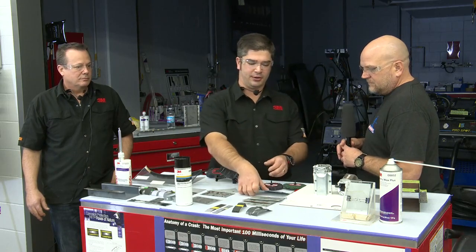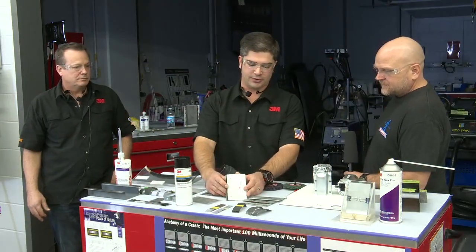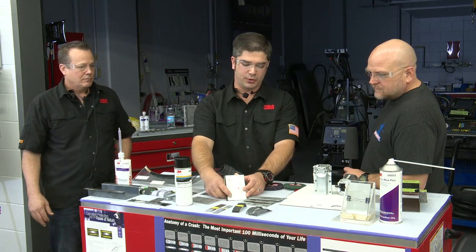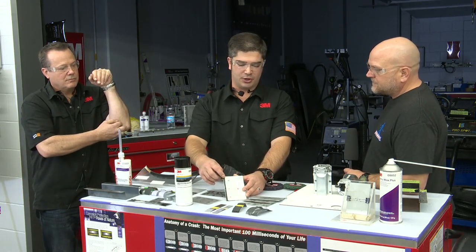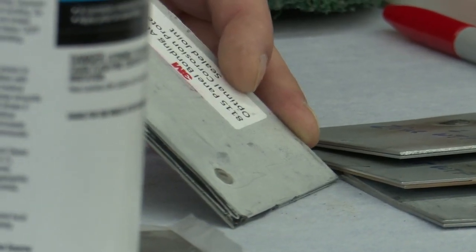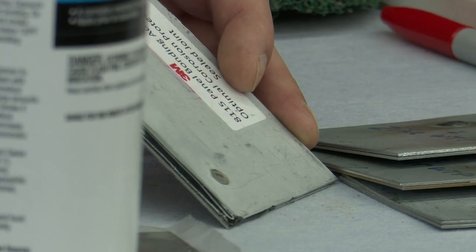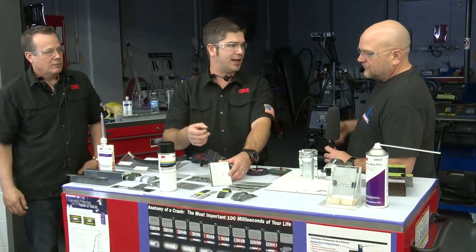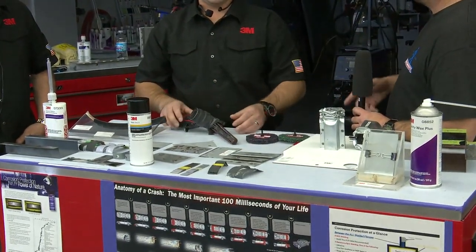We're going to remove a portion of it. In this panel, if you look up close, there are 3 spot welds on here. We're looking to remove just where that spot weld is, right? We don't want to dig into the lower surface, because then we're going to weaken the substrate that we're trying to save and rebond to. Then make sure that our next weld goes next to the original, not on top of it. So thin the metal, use a panel separator, and then trim out the rest.